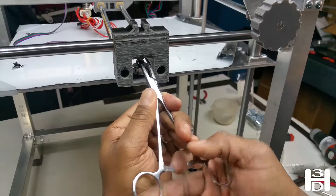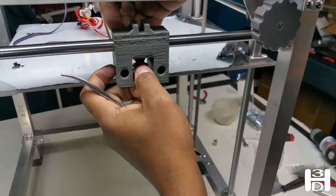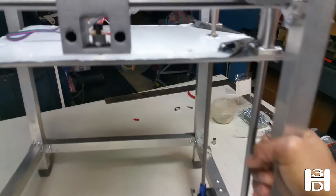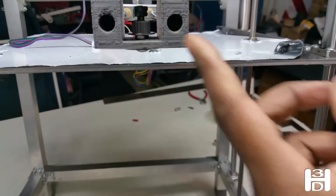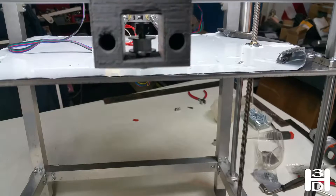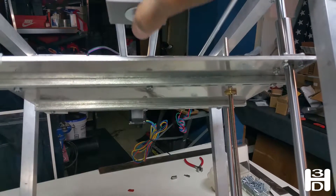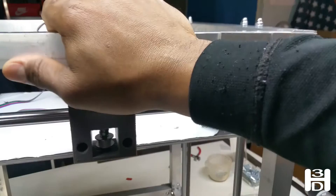There's no reason for this to back off, but this is a device that does move a lot, so it could potentially work its way off just through vibration. So you can see: two nuts — a nut on the bottom, nuts on the top — and the bushing is allowed to have a little bit of travel. The bottom large washer distributes any load pressure from the belt tension across a wider area to keep that hole from punching out in the plastic where the screw is.